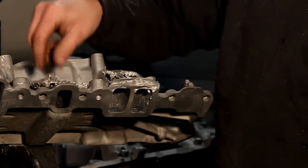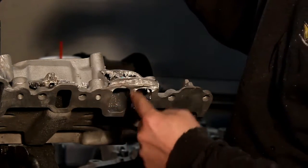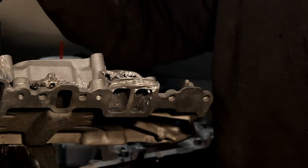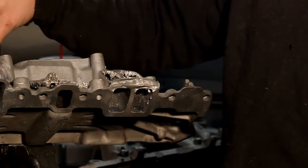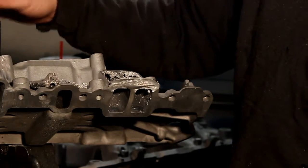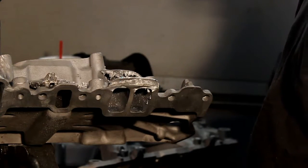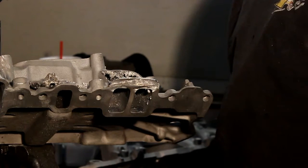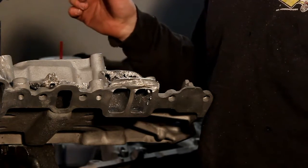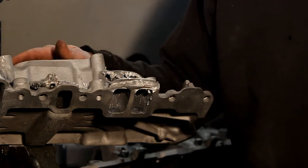So that's that. These will get cleaned up, the ports are going to get hogged out, and these will get cut out to match - I'll just do that with a die grinder - and weld it back together. It'll look like this. This one still needs some work, but the plan is to clean this up and then go back and either sandblast it or peen it and try to make it look like it was not modified. That's enough for today. I'll probably finish modifying all the ports and then the next video will be converting it to multiport. Thanks for watching.